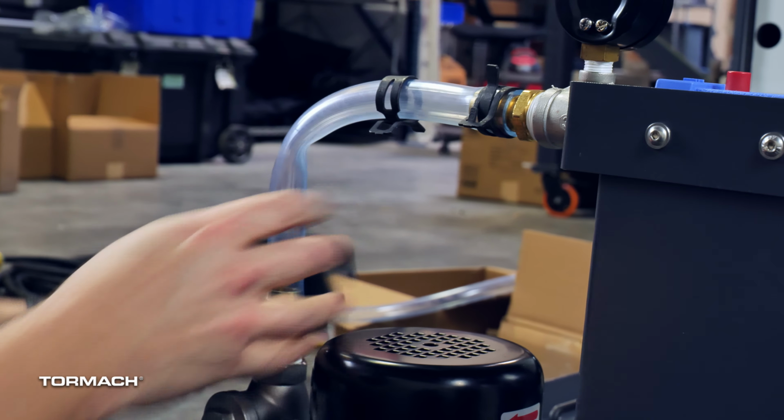Remove the masking tape. At the rear of the mill, remove the 5 screws securing the rear access panel and set the screws aside. Take the panel to a secure surface and have someone hold it down while you knock out the upper left knockout with a hammer and punch.